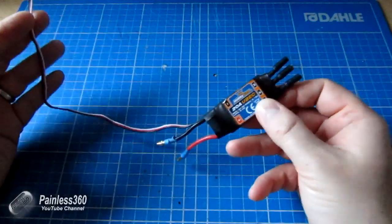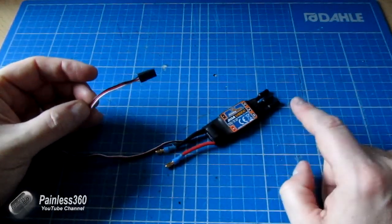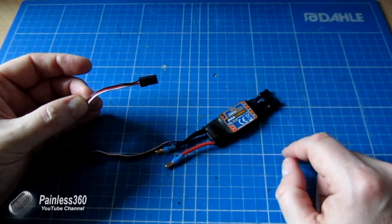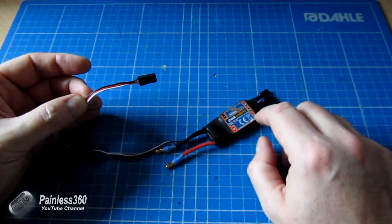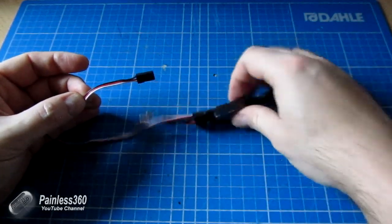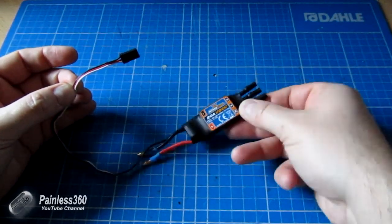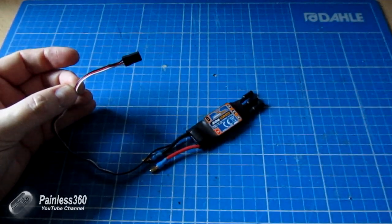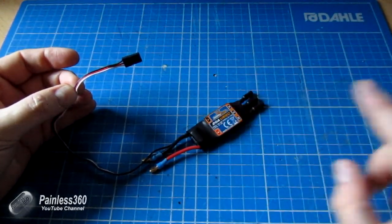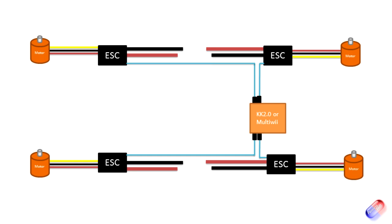The linear BEC is a very simple piece of technology. The way it gets rid of the excess voltage from the battery down to the five or six volts that the electronics on the rest of the craft needs is by dumping that excess power as heat. Behind the big sticker on top of the ESC is heat shrink, and under that is a big heat sink — a big slab of metal. A lot of the heat you get in an ESC actually comes from the battery eliminator circuit, not from the switching itself. If it's a linear BEC, you can plug all of the leads in side by side with all three wires without any problems.